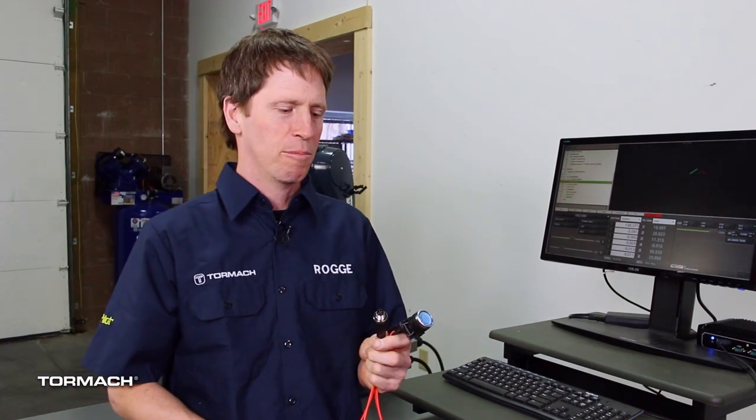To recap: I showed you today how to wire up one of the digital inputs on the ZA6 robot — how to find the schematic, how to read it, and what pins to connect the inputs to. This should work for anything that acts like a switch: a proximity sensor, if you've got a 24-volt proximity sensor you can use the 24-volt supply on the input, or any switch, button, toggle, or reed switch. I hope this video was informative, and thank you so much for watching.